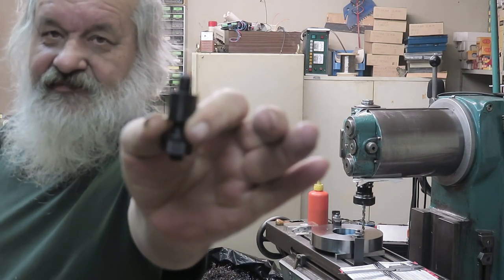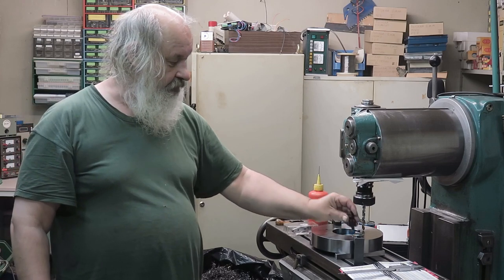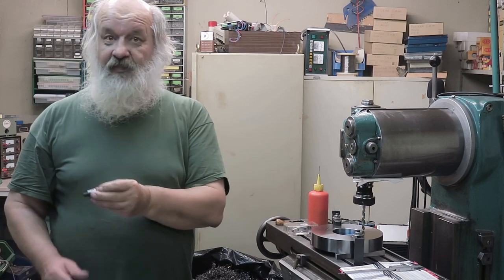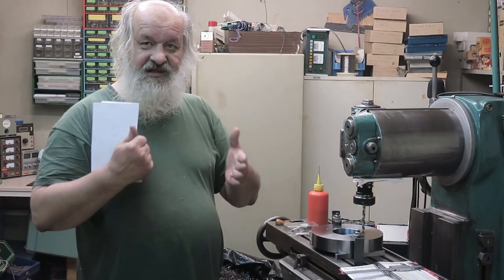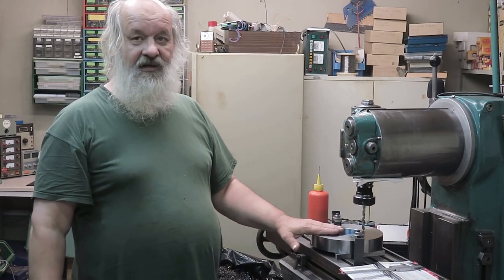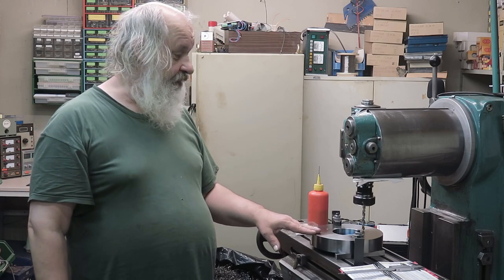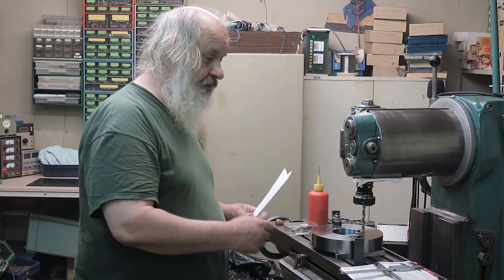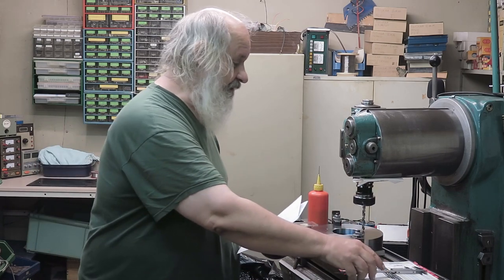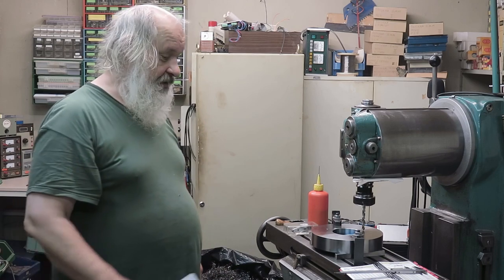These are like this. They are put into four places here. And they are really sloppy on the bayonet itself, because they are not taking part in the centering. They are just pulling this thing into the lathe nose. So, I will now drill these, and the depth, well, I measured it will be 18 millimeters, so it will be 12 turns on this handle.